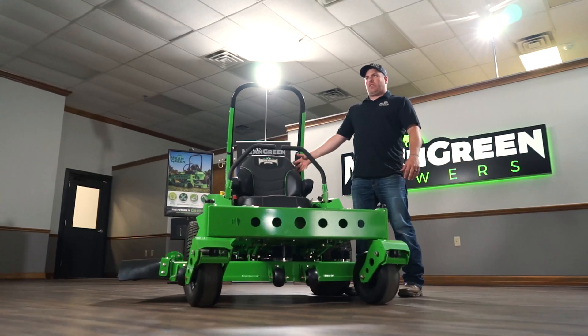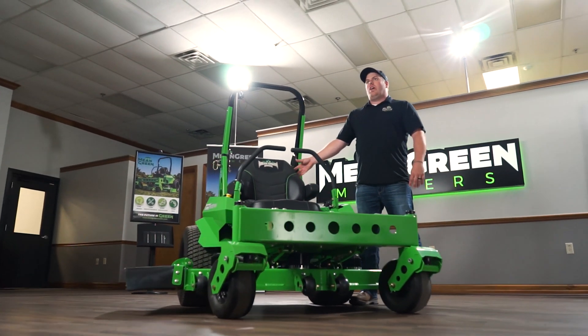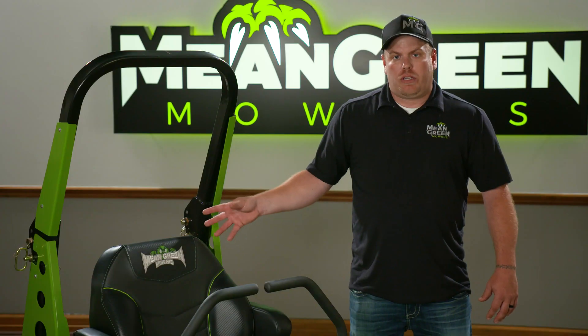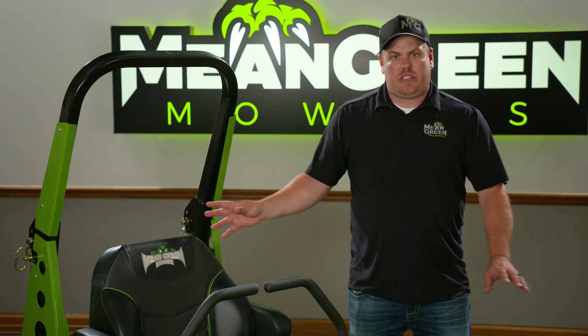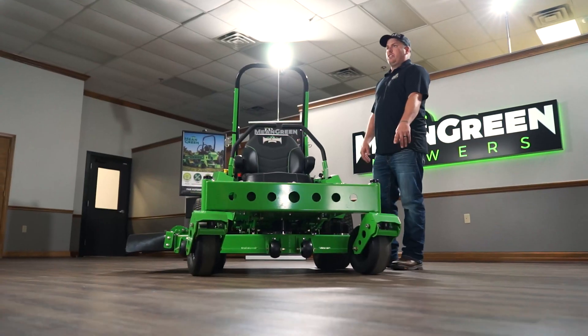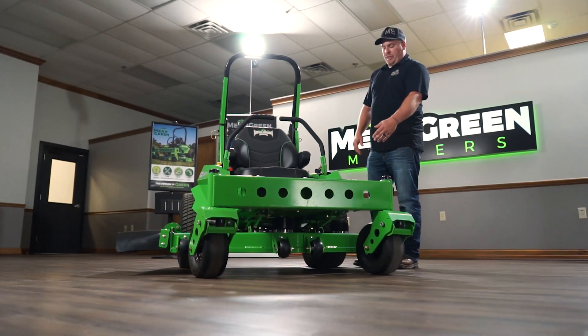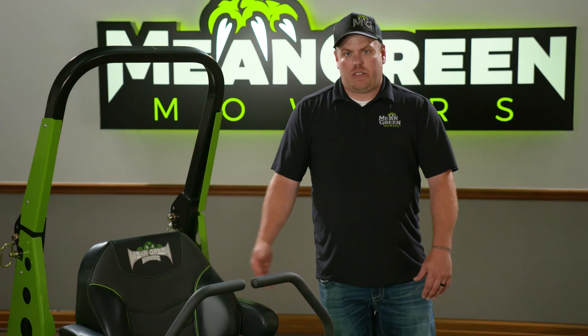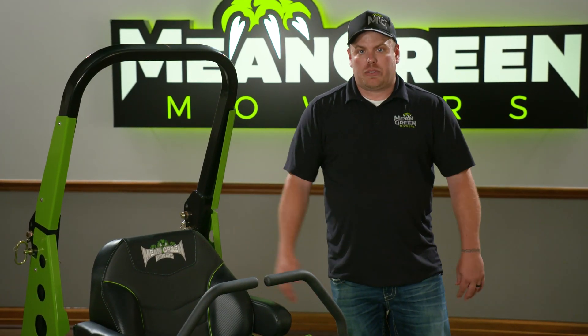What's great about this machine is that there's low maintenance on the batteries as well. This mower can be stored in your garage over the winter — have the batteries charged up about 50%, let it sit over the winter, and you're always ready to go again. The main maintenance of this machine is putting some grease in your front wheels every 50 hours, keep your blades sharp, keep your deck clean, and charge your batteries up every time you're done using it, whether you used it for five minutes or two hours.